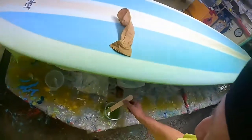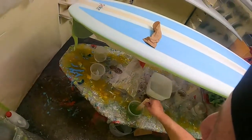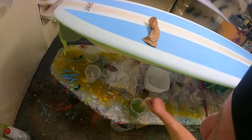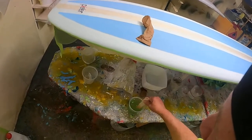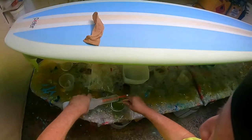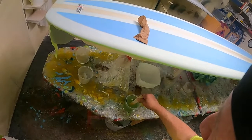What that means is I've got a chance now to stir this in before the resin cools it — it shouldn't because it's 22 degrees — and there's going to be no particles of wax. They're all liquid. So if I can get those wax particles that I've made liquid to mix into the resin, they'll remain liquid. They won't go back to wax. It's only in the styrene it'll do that. When it's mixed with resin it'll become entwined with the resin. Now I don't want it to take too long to go off, so I'm going to do this 12ml finish coat. I'll give that a good stir — about 50 times.